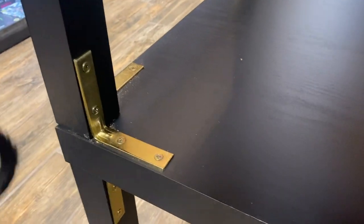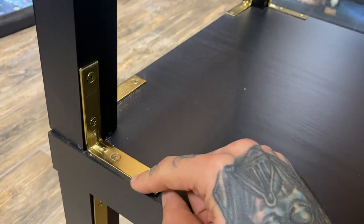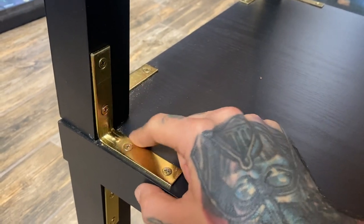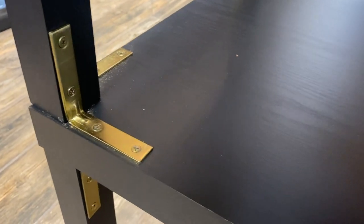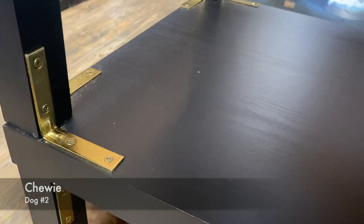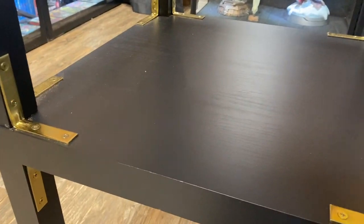I'll give you some tips on getting the most grip on the screws with this particular wood — some of it is hollow and kind of thin. If you come down here and see, I ran the bracket pretty close to this edge rather than directly in the middle, and what that did was give the screws more wood to grab. In the middle it seems a little hollow, but out here on the edge you've got a decent piece of wood. I did a little pre-tapped hole and the screw went right in. I did eight brackets in the middle and eight more on the bottom, and it really gave it nice rigid support.